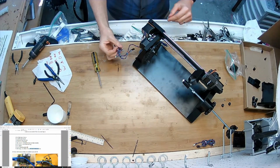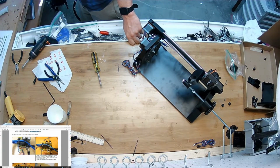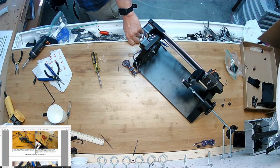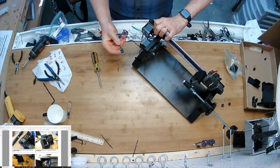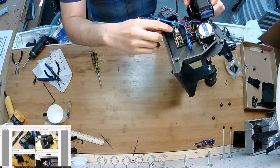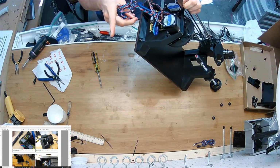Okay, I'm going to take this, the motor cable that's for the long axis. Which jumpers am I going to jump that to? Right, so it's a 4-pin connector, so it could connect on in either orientation. I'm going to connect this one, which is this motor, to the middle stepper driver, which is the y-axis, and I'm going to keep the black wire, which is on the exterior, pointing that way, towards the front of the machine.